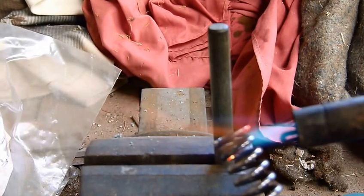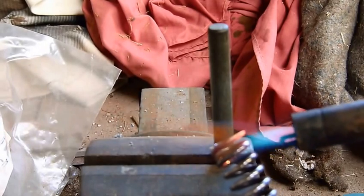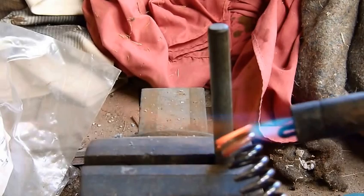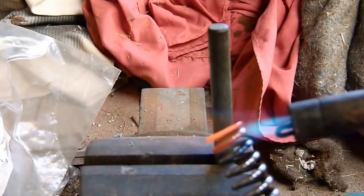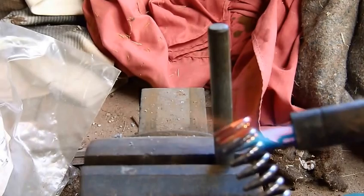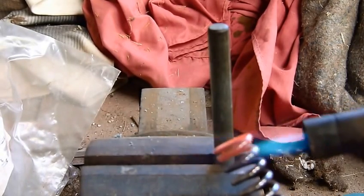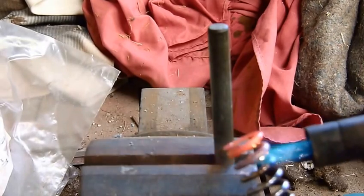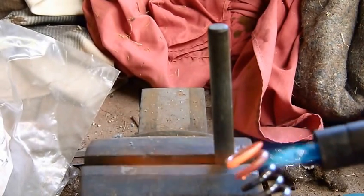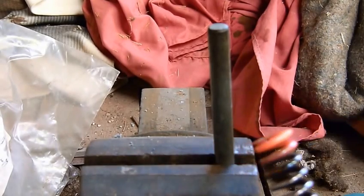The finished part is starting to glow red. Now then, at this point, once it's started to glow red, the steel itself doesn't act like spring steel anymore. It's nice and pliable - it's more like chewing gum. Nice and easy to work. So I'll get it glowing like so.